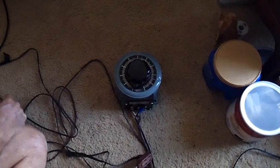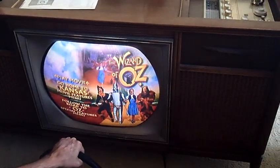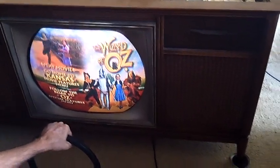What we're going to work on now is — in earlier videos I thought I saw a slight impurity in the CRT. So before I even consider trying to adjust that out through the purity rings on the back of the CRT neck, I'm going to make sure the screen is demagnetized.